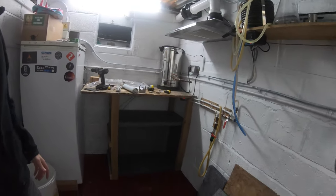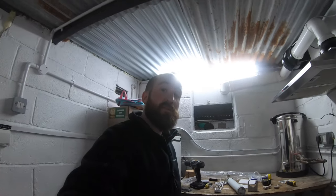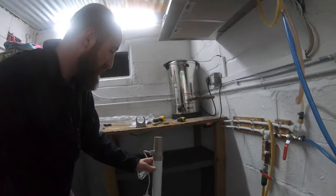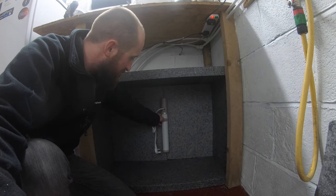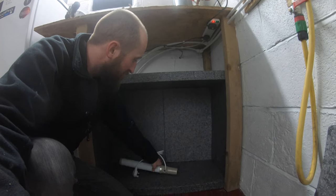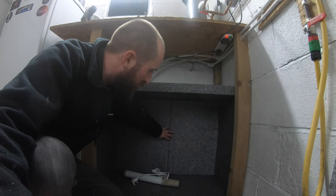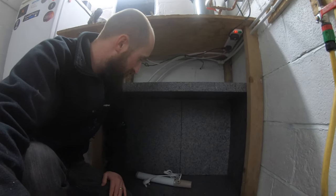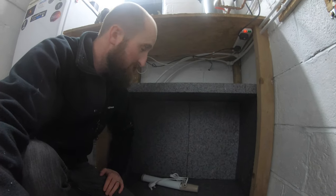I've skipped ahead a little bit and carried on cutting the boards and fitting them in nicely. This is pretty decent — plenty of room in there for two fermenters. The next job is to fit the heating tube. I'm going to fit it round about there to leave plenty of space either side. There's a block of wood I've put behind there to be able to screw the brackets for this straight through, which will hold them steady as well. This is fitted pretty well without any glue, basically — just squeezed everything into place. Pretty impressed so far.